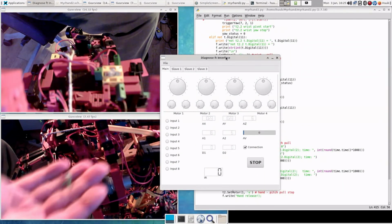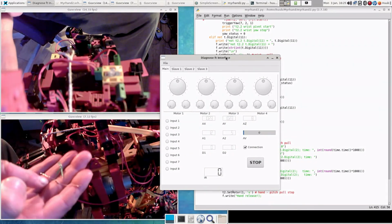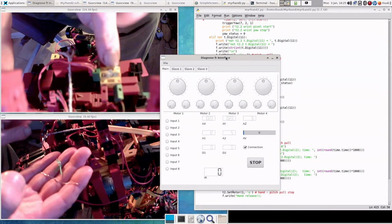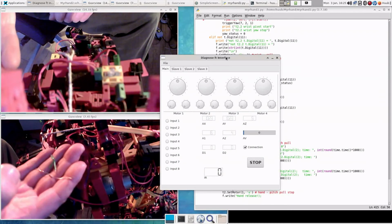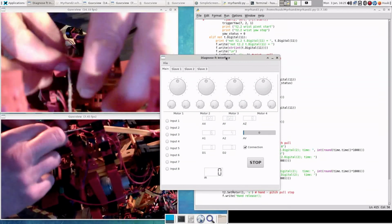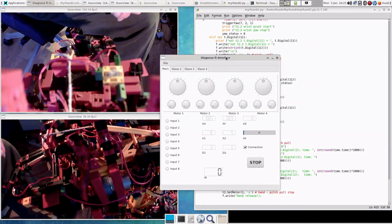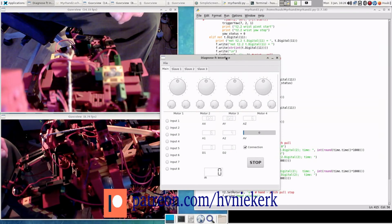Okay, now I have tested this LED, which is proven to work, and this resistor right here. And the weird thing is that it doesn't function while on the battery pack it does. So conclusion is that while this is clearly working, if you look at input 3, then there is something wrong with the voltage, and I measured it, and it's actually on my multimeter showing negative, which is weird in itself.